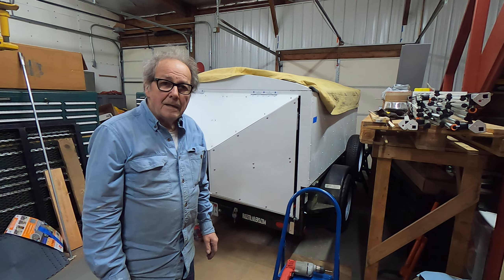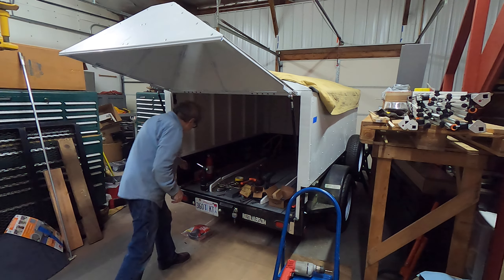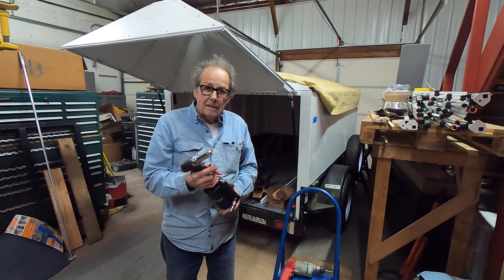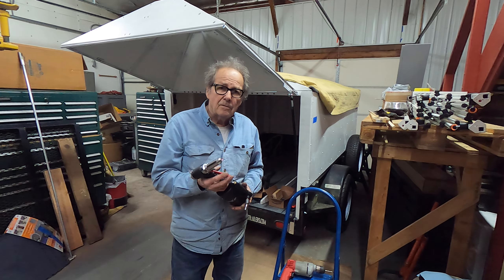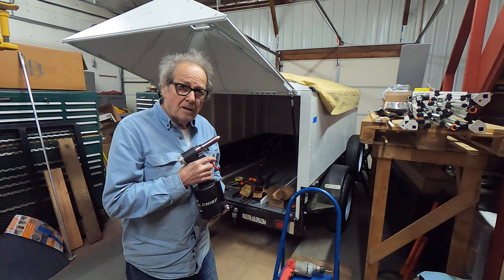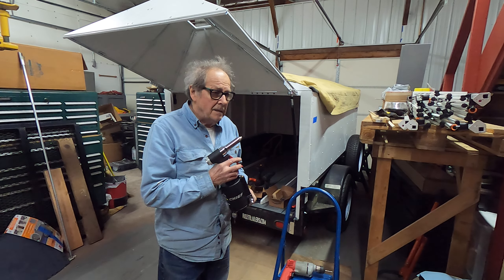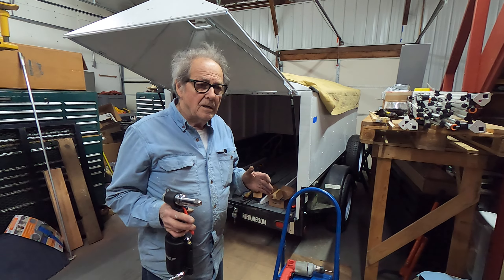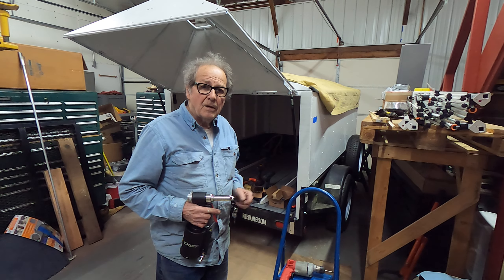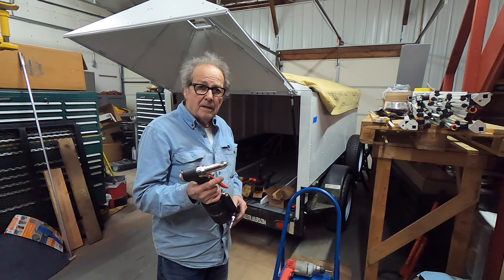Okay, that's about it for today. Oh, I did want to mention one thing. I was going to post something on the forum about this. I've never seen a need for a pneumatic riveter, but I'm using 316 steel rivets and boy, they are a bear to pull. I banged up my knuckles and my wrist this morning just getting a couple of them in, and had to put 8-inch extensions on the ends of the manual rivet gun. And I just gave up — this is crazy, I'll never get 75 of these done without killing myself.